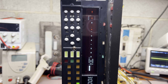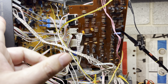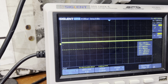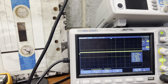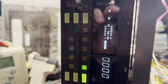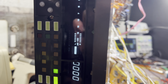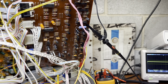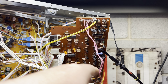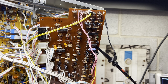Good news and bad news. Good news: the problem comes from this board, not the display chip. There is a small offset above zero — if I use my finger I can see it doesn't return to zero. When I touch it, the levels correspondingly increase and decrease, but don't return to zero. So the problem is an offset coming from this amplifier over time. I believe these capacitors need to be replaced, otherwise it would be shooting right away. Let me recap this board.